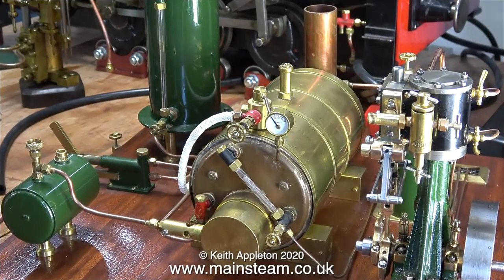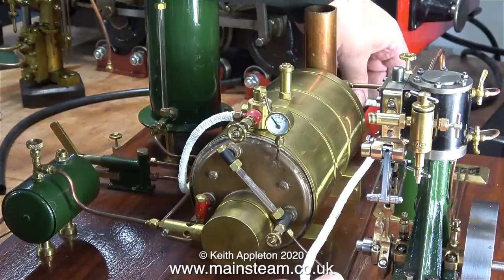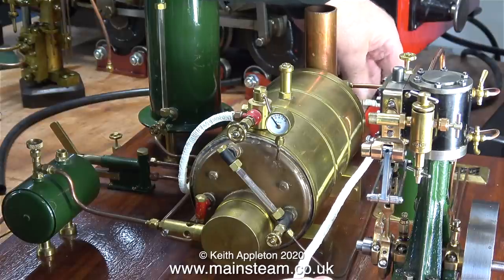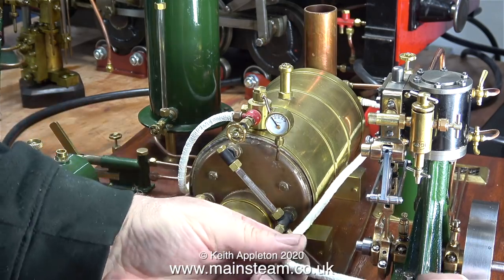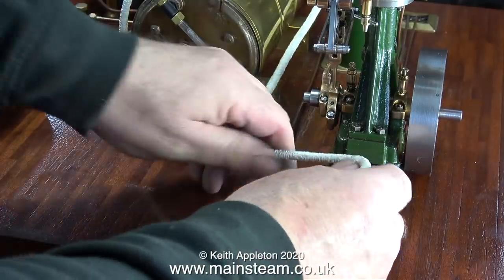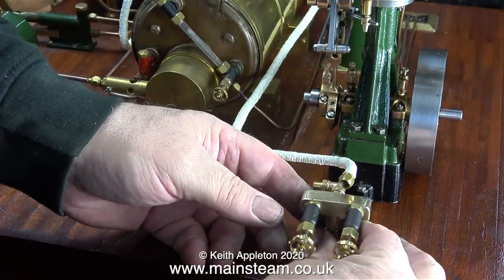The time has come to look at the steam feed from the superheater to the turret. For this I am reusing the existing pipe that connected to the engine. If you've been following this series from the beginning you will realise that originally the main steam feed went into the engine directly into the side of the steam chest, but after I made the modification to the valve gear bracket, the steam inlet is at the front of the steam chest, and also the thread is 5/16x32 now, not 1/4x40 — which doesn't matter because thankfully the 1/4x40 thread on the end of the steam pipe, which I re-bent, will perfectly fit the thread on the rear of the turret.